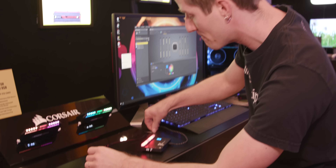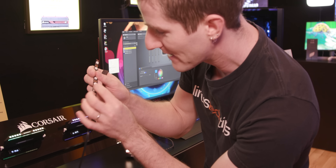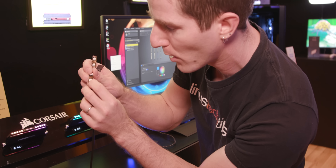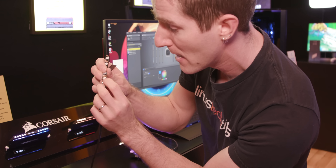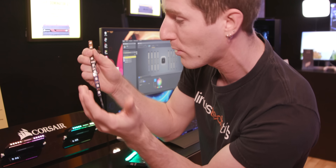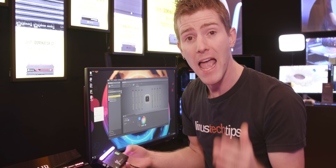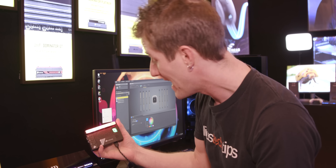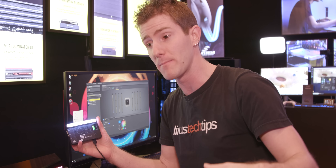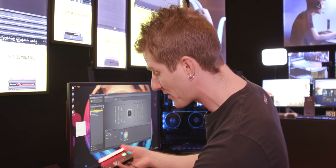What it essentially is, is a method of mounting LEDs — not like the entire surface mount blocky square white thing, but actually the diode itself, just the little dot in the middle that actually emits the light, mounting LEDs directly to a PCB. This increases power efficiency, which in turn can actually increase the maximum brightness of the LEDs, and it dramatically increases their density.